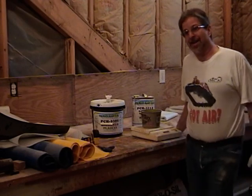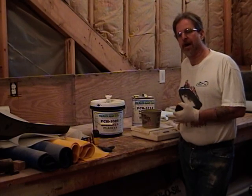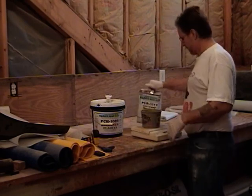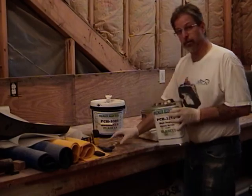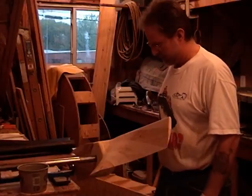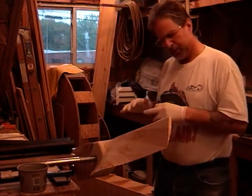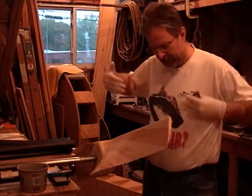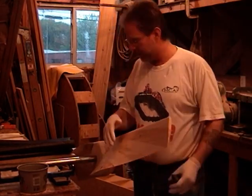It's night eight. I've got the prop set up on a stand and I'm going to start mixing up a batch of epoxy and laying up the blades. I always mix this epoxy by weight for more accurate readings. I've got the epoxy mixed and the prop all set up in a jig. I've got it tipped so that the leading edge is up and the trailing edge is down so all the epoxy runs down toward the trailing edge and keeps it nice and sharp.